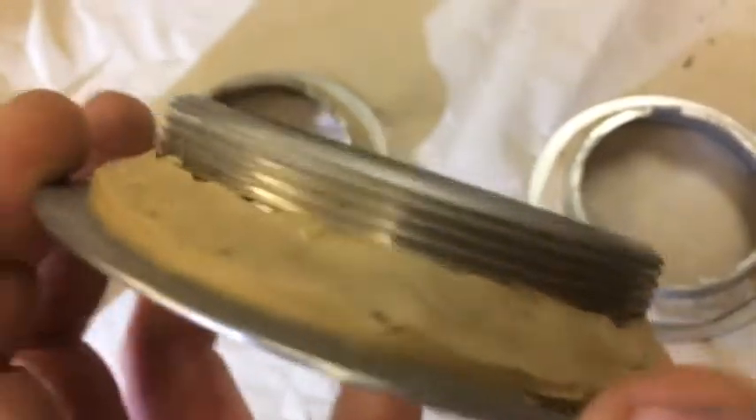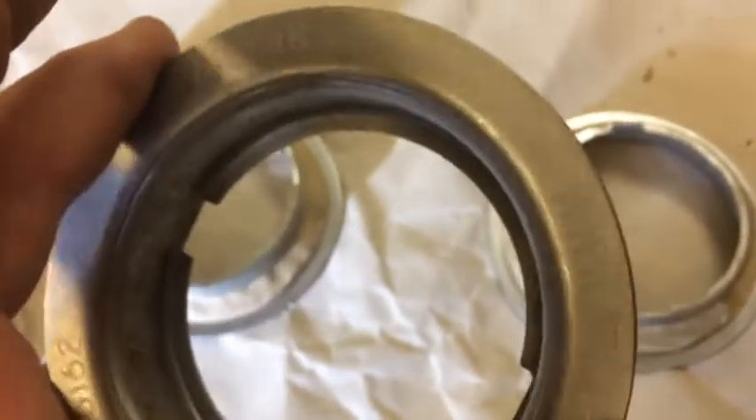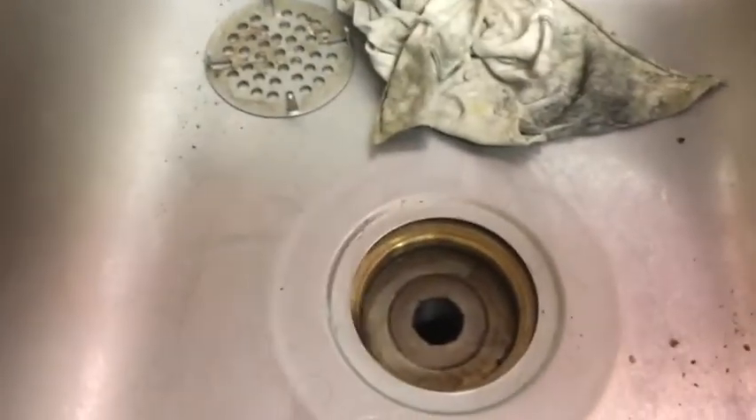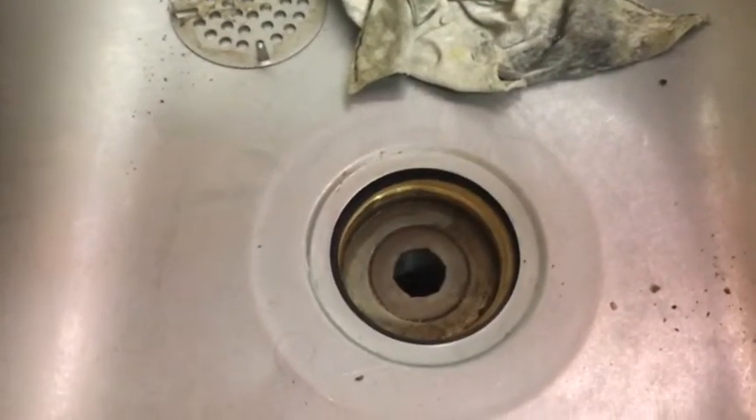Here I'm preparing plumber's putty. Got these flanges prepped with the plumber's putty. It's a good idea to use a little wire brush to make this whole area nice and clean. Switched over to the cleaner rag, make this nice and clean. Here's our nice brand new rubber gasket — reach in from the bottom to make sure that's going to fit nice. Since we've got three of these and I'm not too happy with how this flange is lining up, a little insurance program: I'm going to sneak in a little silicone around this side, and then the putty will be on top. Between that, our leaky problems will be over.